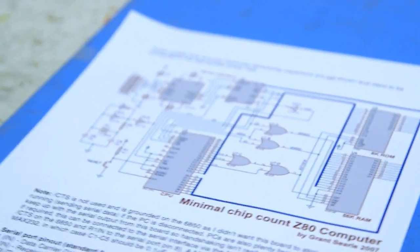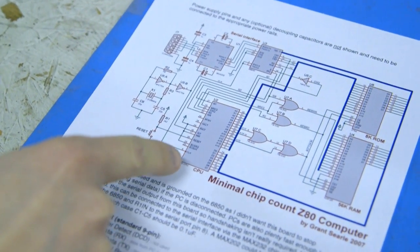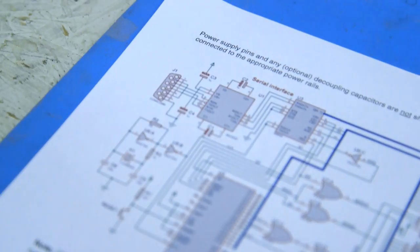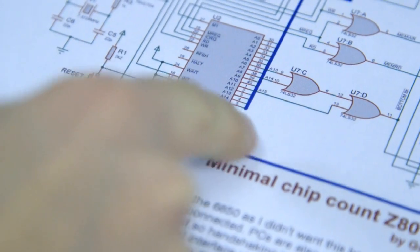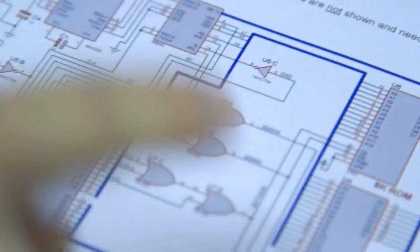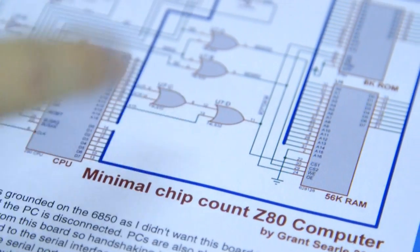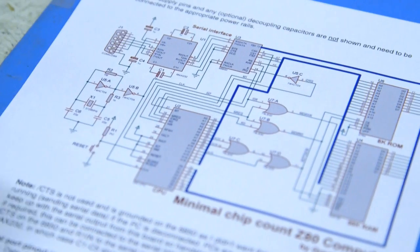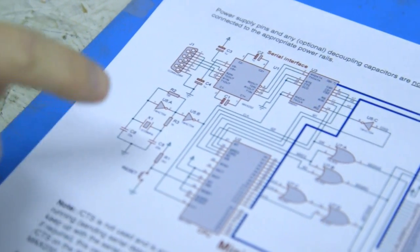This is the schematic of the computer. In the middle we've got the Z80 CPU connected via the address bus to the RAM and to the ROM — that's the green wires going round. I've got Microsoft BASIC on the ROM, which also connects round to the serial controller. You've got the data bus going round to the RAM and the ROM — the 8K ROM with Microsoft BASIC, and a 32K RAM chip because that's what I had handy. There are also logic chips to select the right addresses on the ROM and RAM, and a timing circuit which runs the clock.